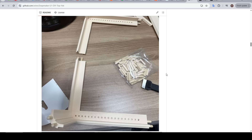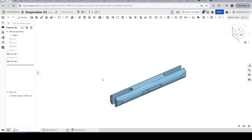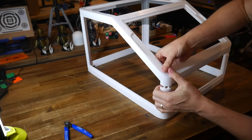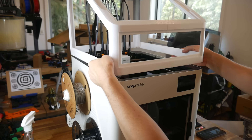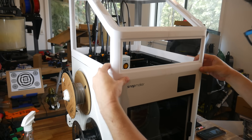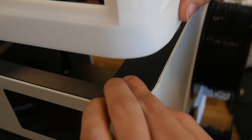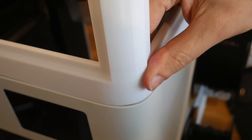The pieces go together like a jigsaw, using wooden dowel pieces to connect them. I avoided the wooden dowels by keeping everything 3D-printed with a custom dowel design — 40mm long and slightly oversized in diameter, but with a gap in the middle so it can flex shut, and a flat surface on top and bottom so it doesn't fall off the bed. Putting the frame together was like doing a 3D jigsaw puzzle. The frame just goes over the top of everything, sitting on top of the printer. One component ensures it sits without wobbling — four printed feet that interface with the rubber stoppers in each corner of the frame. These are a simple interference fit and allow the lid to be lifted off after installation.